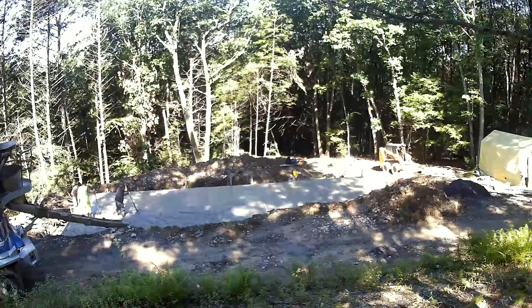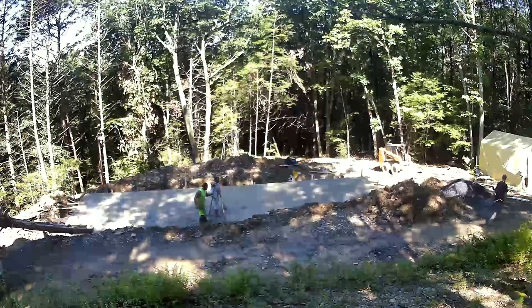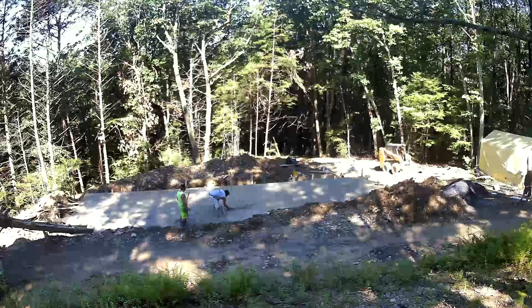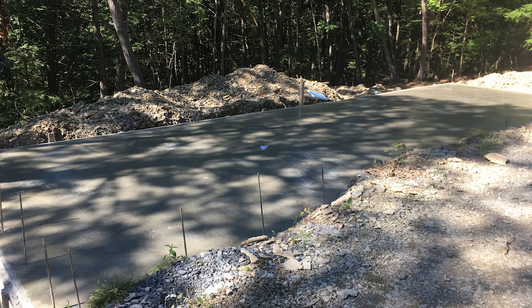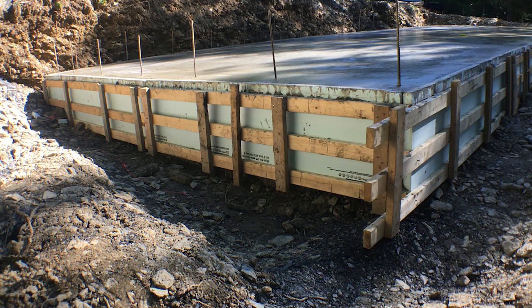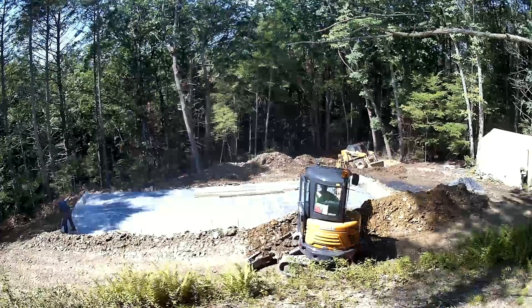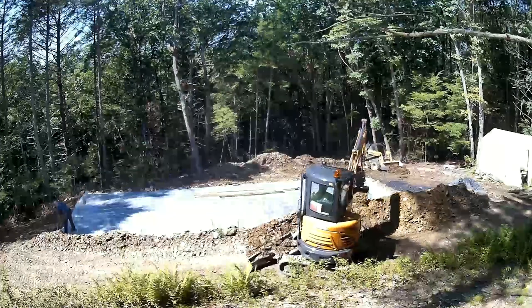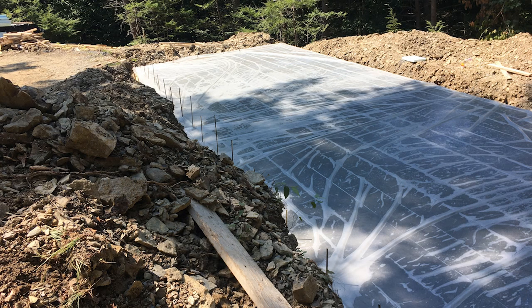If you're a homeowner it seems like you need five guys to help you. They had tools I don't have — they had this giant vibrator that vibrated all the air out of the walls. You also need to put plastic over the cement while it's drying. The water tries to escape the cement and the plastic keeps it from escaping, making it stronger.